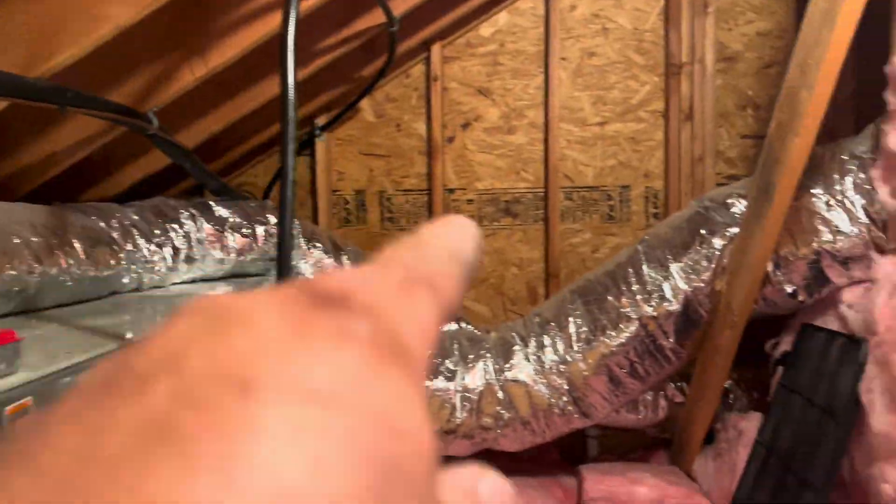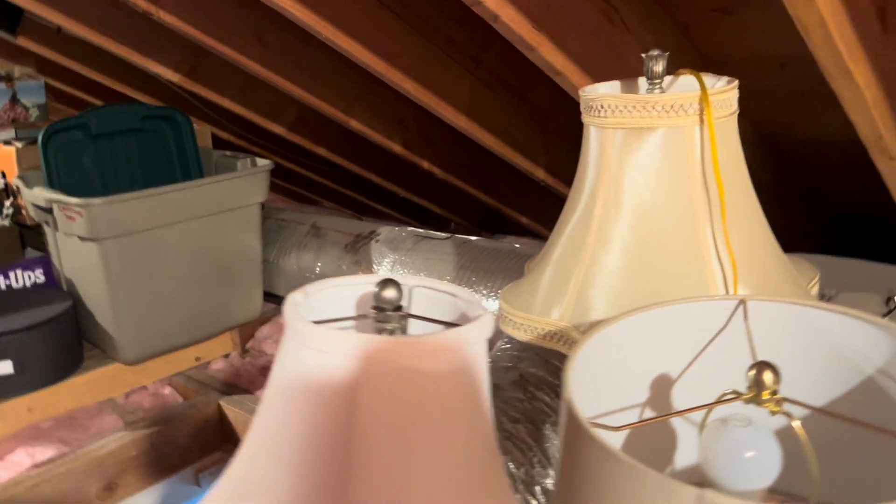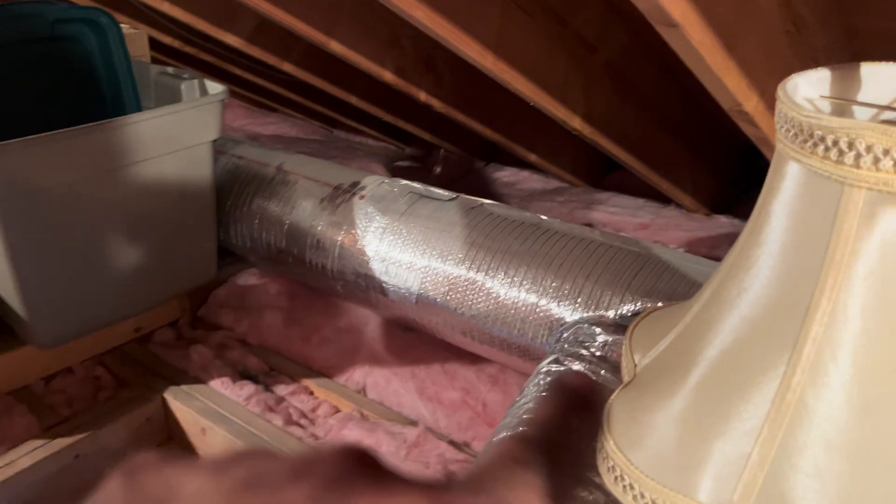I think it's oversized — well, undersized for all this. You're trying to come up over here with duct board, then a big piece of flex. It almost looks like they put an addition on here. Then you have a hard duct over there that comes all the way out — a little 18. You've got a little ton-and-a-half with all this extra hackery flex. Flex is great but cut it to size, dude. This is crazy.